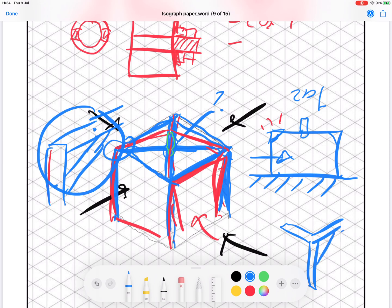So then you have your cross beams going like this in equal direction. So you can still have that beam going off into make the peak of the gazebo structure here. But this will just mean that it's far more stiff in the lateral directions, because these forces can come in at any direction.